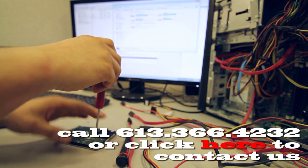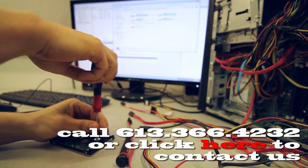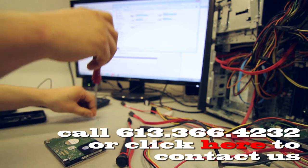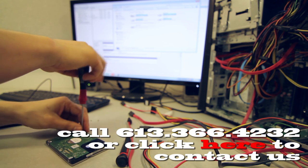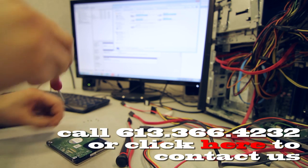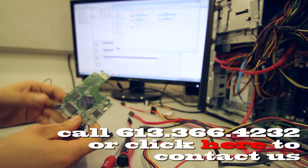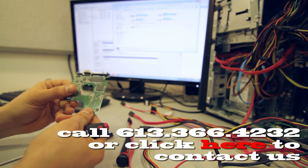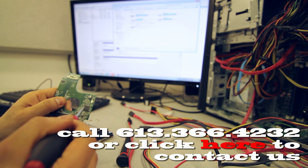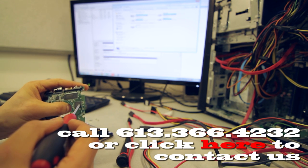The way to confirm that they're compatible, without knowing what the part numbers need to be, is to have a look at the bottom portion of the PCB. I'm just going to remove all these T6 screws. And this is what the board looks like. The parts you need to match are the controller and the spindle controller. The first two lines here and the main line here need to match up.